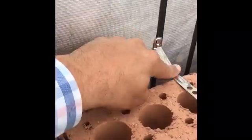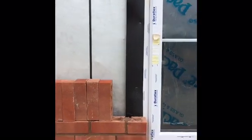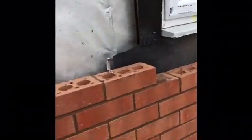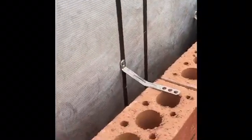There's a brickwork tie here so any water comes down and out. These black bits of tape indicate where the studs go for the brickies to fix their ties — you can't just fix it anywhere. We've got seals going in afterwards. So with brick on the outside, what the NHBC inspector is looking for is a nice clear cavity.